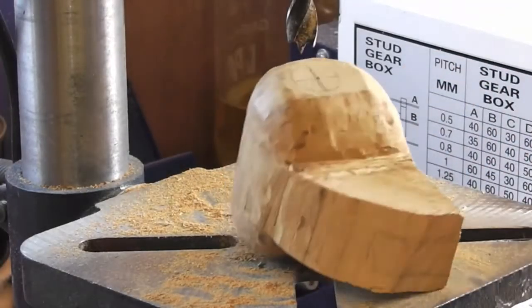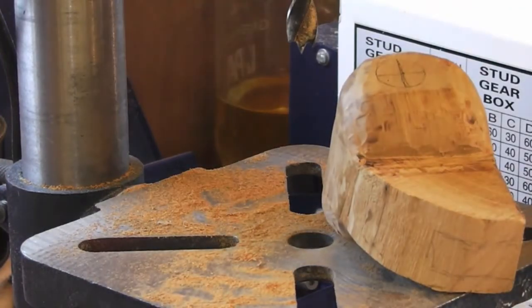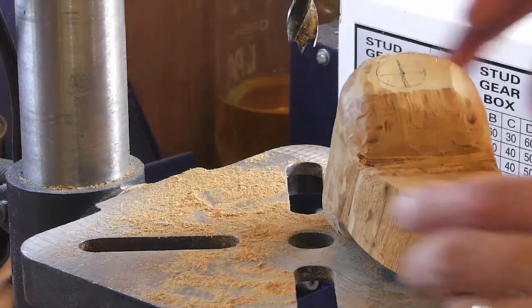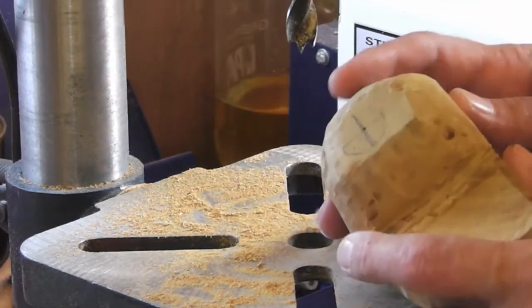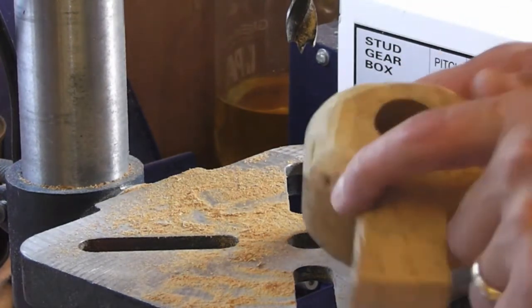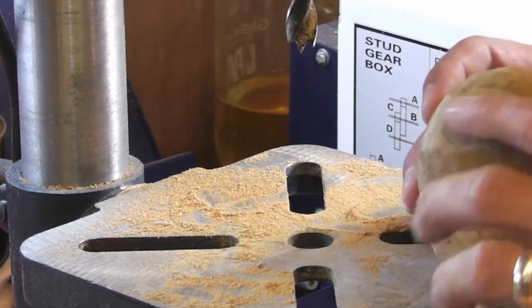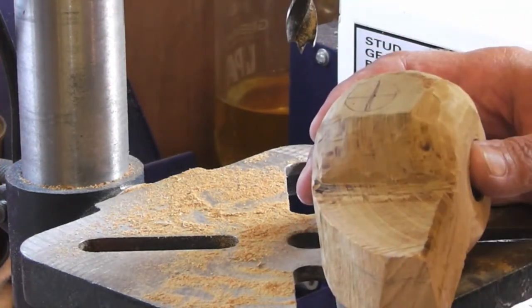Right, so I'm over at the drill. Now the one thing I didn't check, whether I had power. If I don't, that would be stupid. Turn some power on for there. I've got a 12mm bit in here. I'm just going to drill this out to a 12mm, effectively trying to go through as far as the cavity as I can in there. And then what I'm going to be doing is probably routing out the bit for the switch.